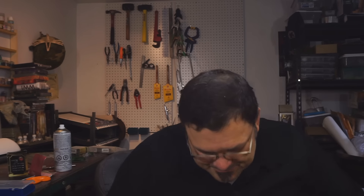These are the final pieces that just remain to have some cleanup work done and then paint. And these are some of the iterations of pieces that didn't work for me — it was usually sizing issues. It turns out you can't make things perfectly sized. If this is a five-millimeter diameter hole and this is a five-millimeter diameter peg, the printing process isn't that exact, so it requires making one smaller or bigger so they can actually fit inside one another.